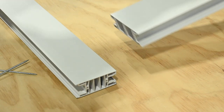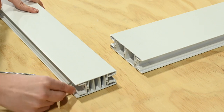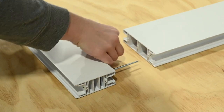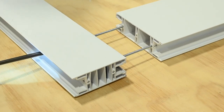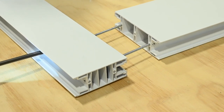Next, install the bottom rail. Place two of the 4-inch screws into the two holes in the outside of the stile channel, making sure they are fully inserted. Line up the bottom rail with the stile, making sure the side of the bottom rail with the thinner channel is facing up towards the top of the door. Place the end of the bottom rail against the screws, lining up the holes in the extrusion. Once in place, continue tightening screws until stile and rail are flush and secure.